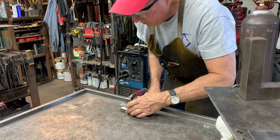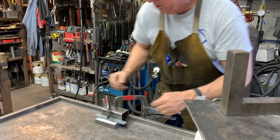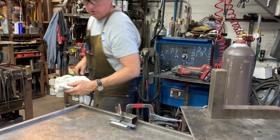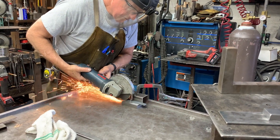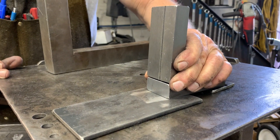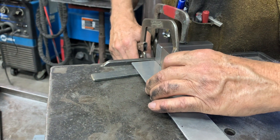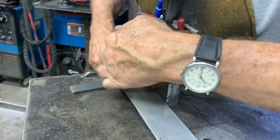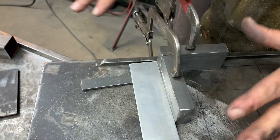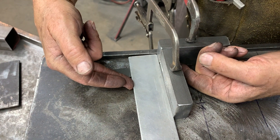This is not going to be to the ten-thousandth of an inch. This is a shop-made tool where you're going to get yourself very close to what you want — that's going to hold it in place. I'm just going to line this up by eyeball. I want this surface and this surface to be square to each other. I'm using cold rolled material; I've cleaned off my table so it's sitting really flat, so I've got a pretty high degree of confidence this is going to work.